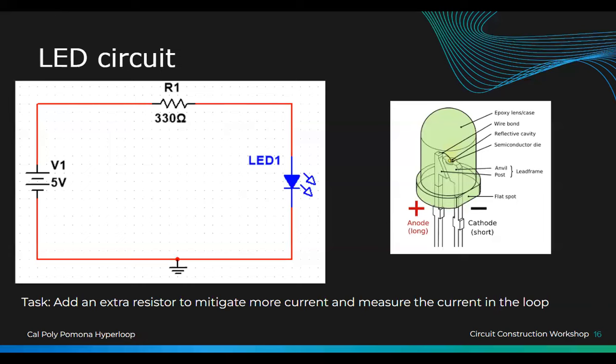And look at the schematic. You see this right here, it's the diode. The positive is on this side, negative on this side. A good hint is that the negative has the bar. The current flows from positive to negative, so the arrow is going down. So what I'm going to do is connect the positive to my resistor rail, and then put my negative into the rail of the negative. You can put the resistor in the front or the back. You can either put it here or swap it. It doesn't matter.